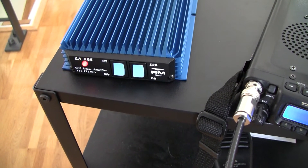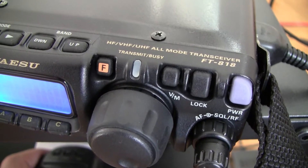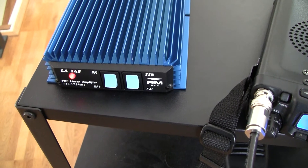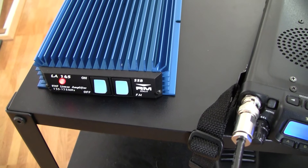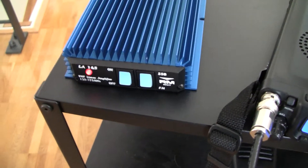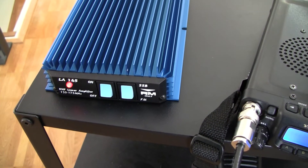Because the radio is telling the amplifier over the external PTT control that it wants to transmit. It's like you have that little LED here — that is now turned off. If I turn it on, that is when the radio would tell the amplifier it's in transmit mode, so you should do it too. But this amplifier does not have that feature, so in order to avoid the relays switching between transmit and receive all the time while you are speaking and swallowing words, they have this switch to add a little delay.